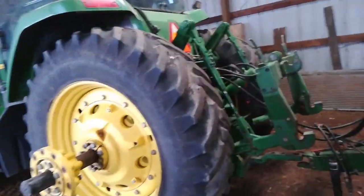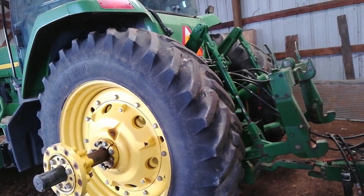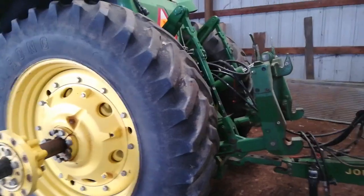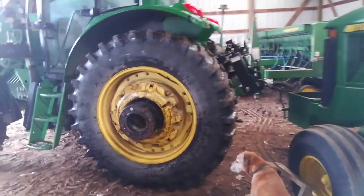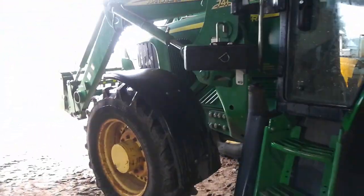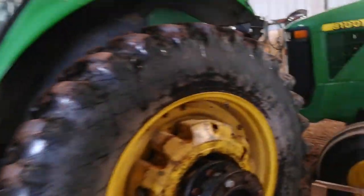The 8100 seems to be pretty good. It's got a hitch position sensor fault code that I don't think is a broken wire, but I can't diagnose it — and even if I could, I can't recalibrate without software. So Ronnie's going to have to come out from Deere and fix that. This one needed a new battery, 400 bucks this spring, but it had squirrels nesting in it. I got them cleaned out and they didn't chew any wires, I don't think.